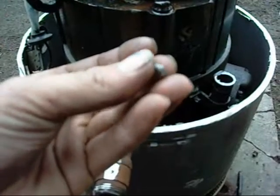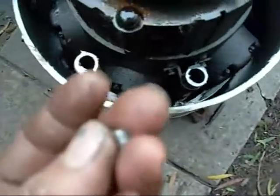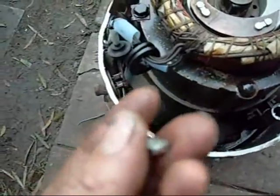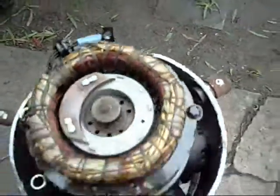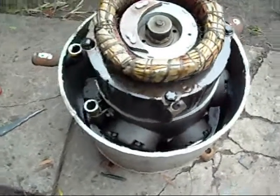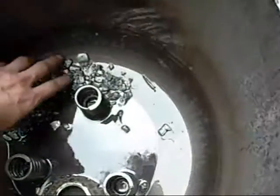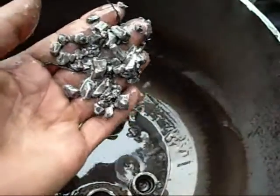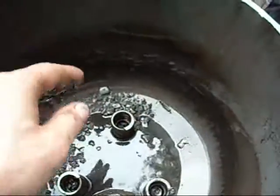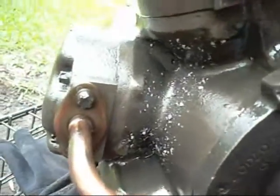I just found this little lump of pulverised aluminium sitting on top of the cylinder head here. I'm guessing that's not a good sign — definitely wouldn't have come from my grinding work. The way it's been ground up, I'd say she's thrown a rod and continued to run on five cylinders for a very long amount of time. Unfortunately I think this is the bad one. The motor will keep spinning, especially because it's a tandem system — one compressor ends up doing all the work while this one self-destructs. There's a splatter of aluminium particles up there.